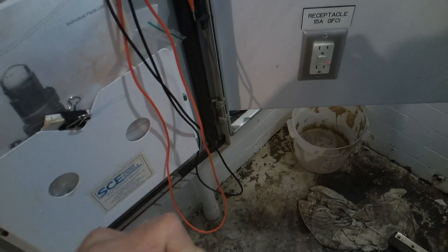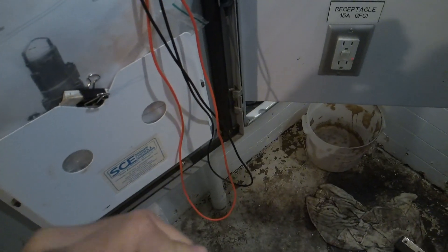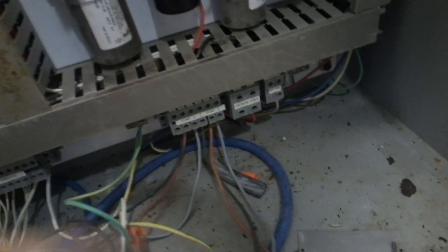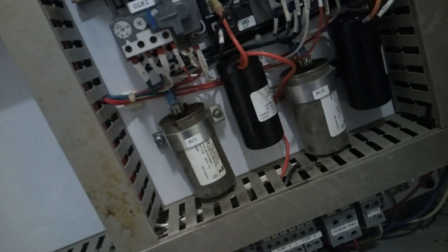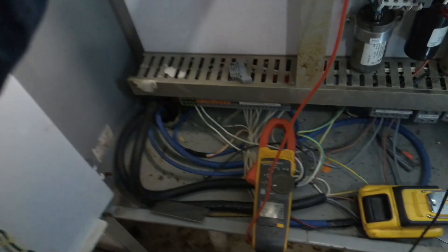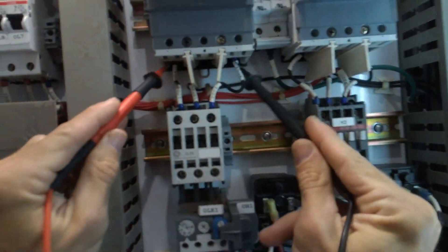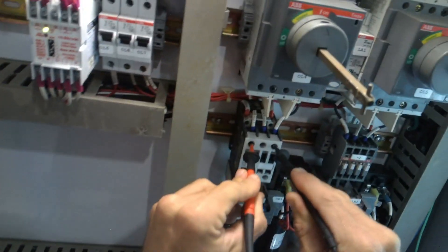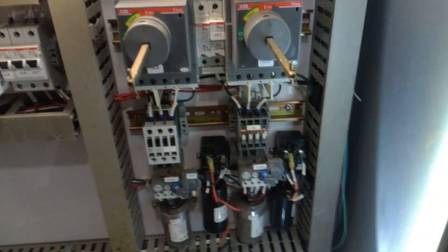Do we have a picture of the pump nameplate that was put in the hole? That would be nice, just to verify the easy obvious stuff. It was pump one, so you guys reconnected them right back how it was. I caught all the wires one by one, but that contact in the middle — I don't know, it was sparking yesterday. It looks a little sketchy. We've got 215 volts there, 215 there, 215 there. This is single phase and they're using a three-pole contactor on single phase.